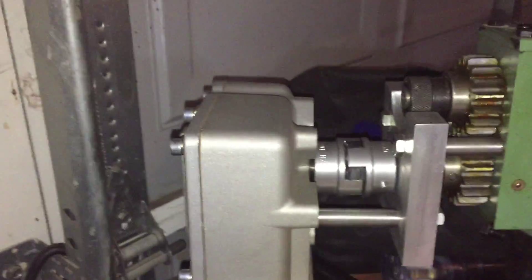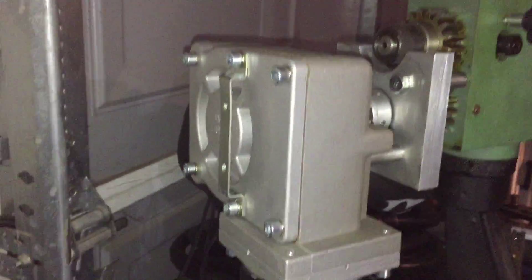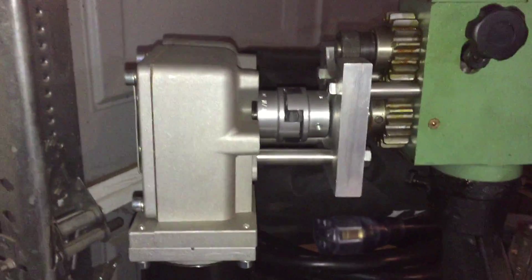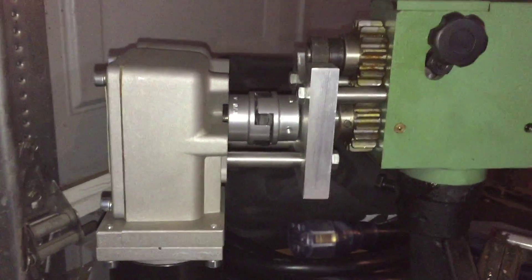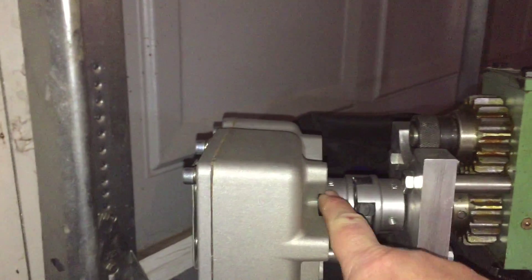This type of motor is a 12-volt gearbox motor with a 90-to-1 ratio, so the motor shaft turns 90 times for every one turn on the output shaft — a giant gear reduction. It claims about 0.9 horsepower out of 12 volts at up to 36 amps rated draw. I have a Lovejoy coupling joining the two shafts together.